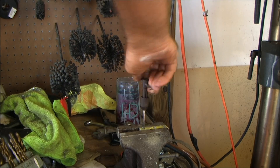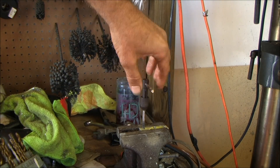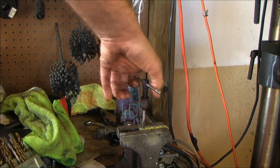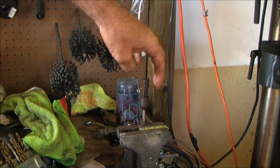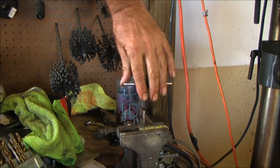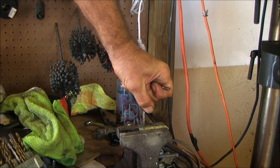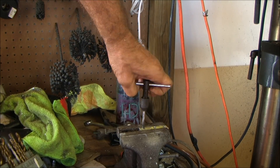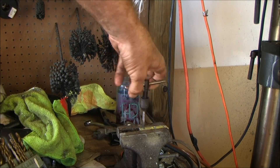I drilled these out the right way — for a 6mm hole I used a 5.65mm drill bit to make these holes. My threads won't be super deep and my hole isn't too tight, but it's a good tight hole. The tighter the hole, the more threads you'll cut — a little extra work, but if you get it too tight you'll wreck your tap and it takes all night. Get it too loose and you won't get any threads. You want it just right — nice and tight but not too tight — and you'll have good threads when you're done.